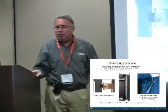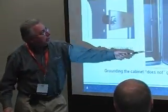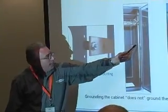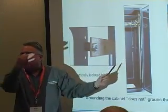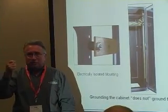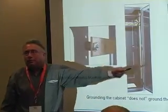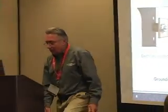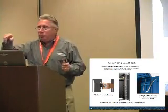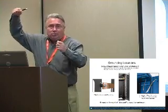We have Cisco documentation saying they want their equipment grounded to an earth ground. What is recommended is a separate green vertical or horizontal bus bar. There are capped holes, and you run green leads from there to the green grounding screw on the equipment. You can rely on the plug's ground, but manufacturers call for a direct earth ground to their equipment. Grounding the cabinet does not ground the equipment — a lot of people's warranties were nullified because of this confusion. Best practice is a separate earth ground bus bar with a green lead directly to the ground screw.